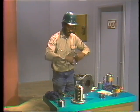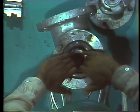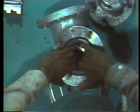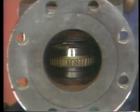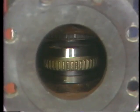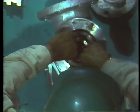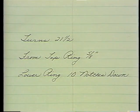The ring is installed in the valve body — he first turns the ring counterclockwise to help mate the threads on the ring with the threads in the valve body. Once the threads engage, he turns the ring clockwise so that it threads downward into place. Of course, turning the ring like this only places it in approximately its original position. To be certain the ring is positioned exactly right, the same measurement taken during disassembly must be repeated. The mechanic checks his notes.